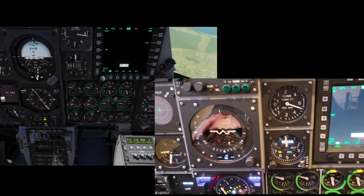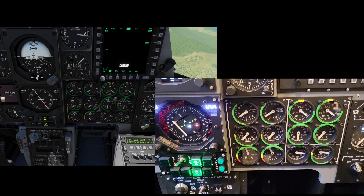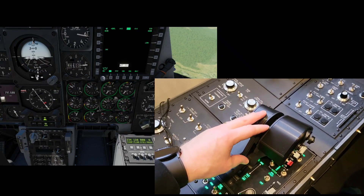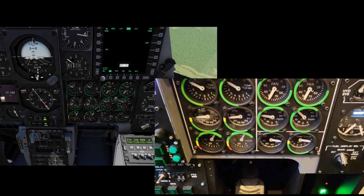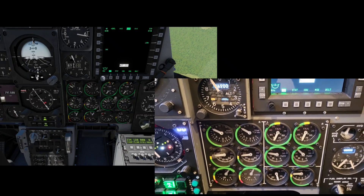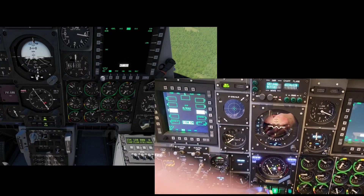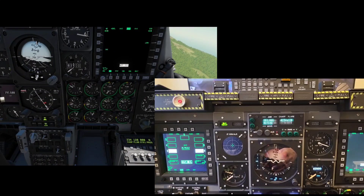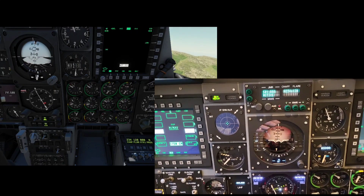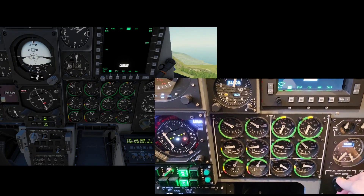Let's have a look at the EMI and also the right-hand side of the front dash. If you look at the fuel flow gauge for the left engine, you'll see the needle slip — that was just one of the three deficiencies I mentioned. The EMI panel we can see is version 2. I previously built the EMI panel, but I built this one with the intention of it being more efficient in its use of Arduinos — it uses fewer of them, has coloured bezels, and slightly different dimensions. Ironically, one of the things about the new one is it's easier to maintain, but the reason it now needs maintenance is that the pointers weren't glued to the stepper motor shafts, which is the reason for that needle slip.